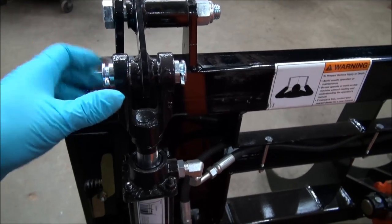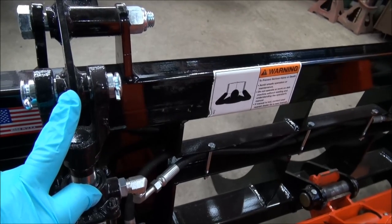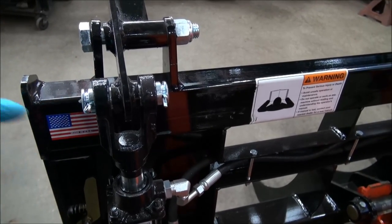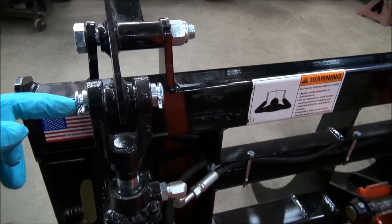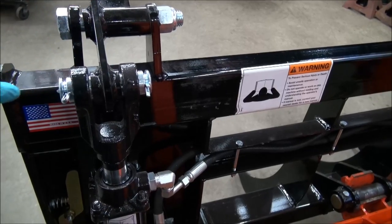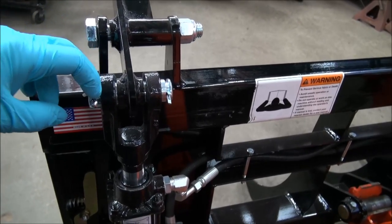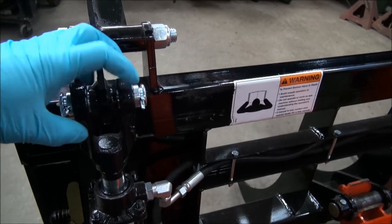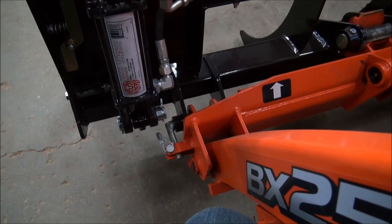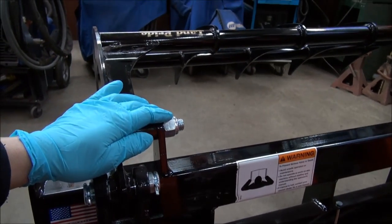These here are a nice fit and they work well. But the problem is you can't put a grease nipple on this. So what I'm intending to do is take this pin out altogether, cut this section off, drill it out halfway with a small hole, cut a relief groove inside, then drill it down through and put a grease nipple on the outside. I won't be using a cotter pin anymore — I'm going to use a c-clip to hold the pin in. That way when I grease it, the grease will come out through here. We're going to do the bottom and the top and the two bolts.